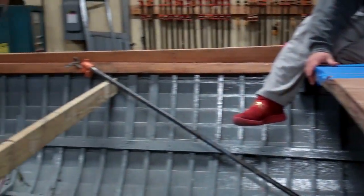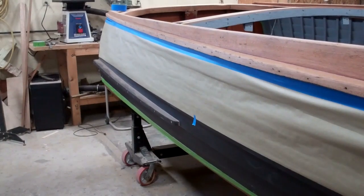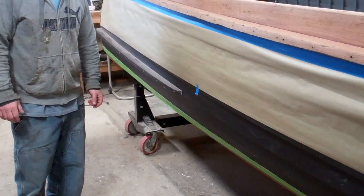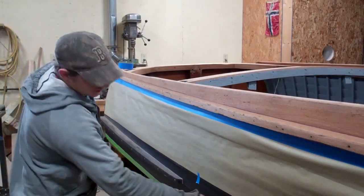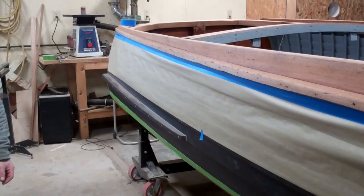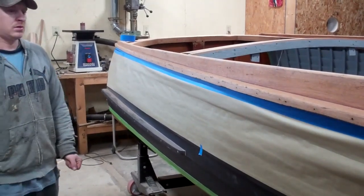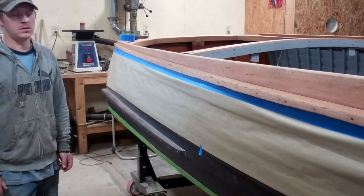The topsides were painted provisionally with a low-luster black paint. What we concluded is that it's really left a finish not unlike a chalkboard — you just touch it and it leaves a mark on the boat. It's great paint, but it's not a great finish; it's a great primer and base coat. So we will be applying three or four coats of Pettit's Easy Epoxy topside paint in a high-gloss black, which should really make this boat pop.